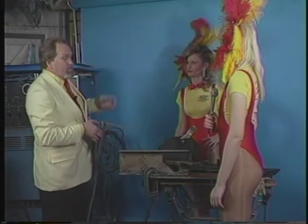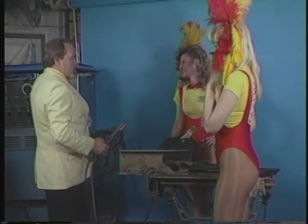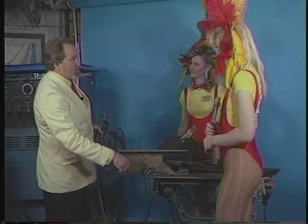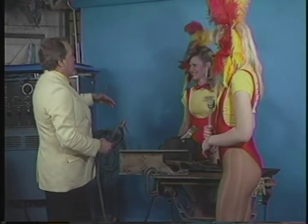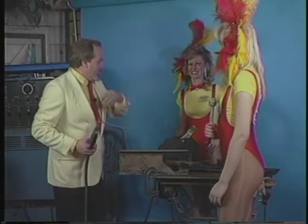Because really, in effect, if we were talking about temperatures, we'd call it temperature. We say, give me some more heat. We're not really talking about temperatures, we're talking about amps, because the temperature has to remain consistent. We're looking for the temperature that will melt the steel, and we're certainly not changing the temperature. It's slang, okay? Chuck, is that a good explanation? Okay, great. He's giving me a thumbs up.